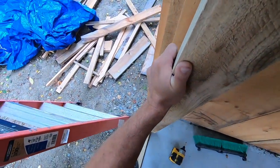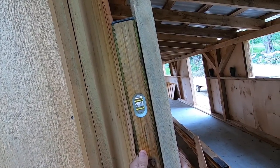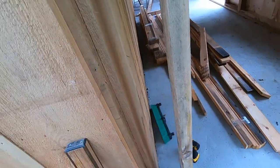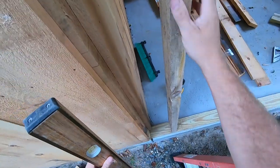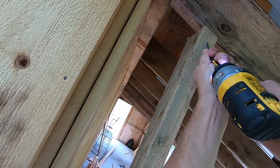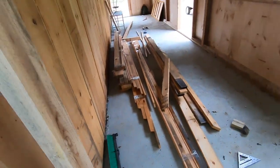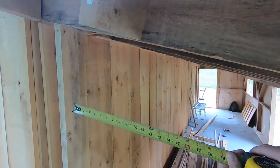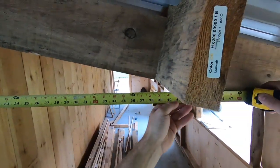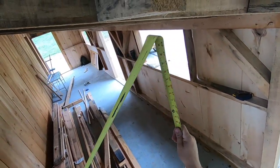Let's get our king stud in. The top needs to go over just a tad. I like it right there — we're nice and flush. Perfect, flush there, still on our line. Let's get a measurement from there: 46 and 5 eighths. Mark 46 and 5 eighths over here. This way, when we pull our measurement, our tape measure is fairly straight — if it's not, if we were off, we could be up to an inch off.